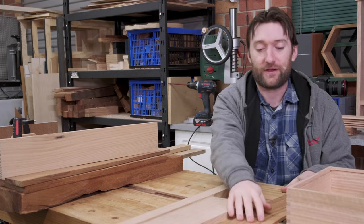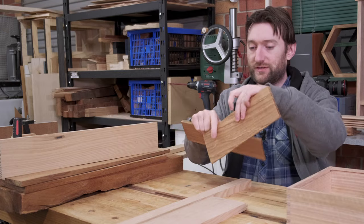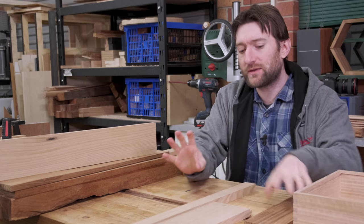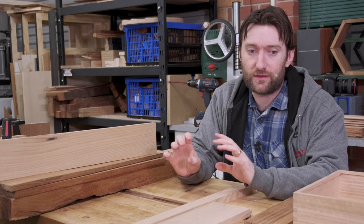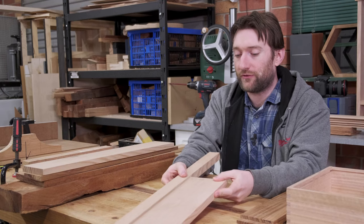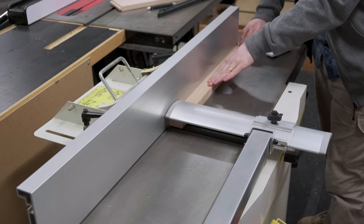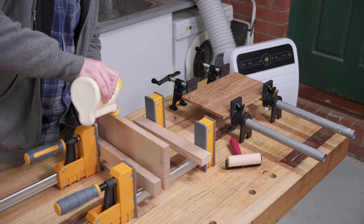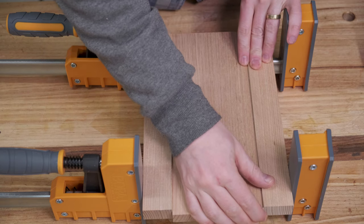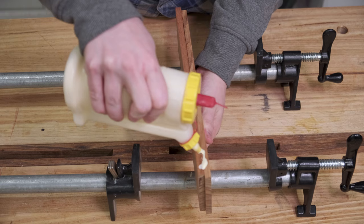For the bottom panel, I found this nice piece of blackwood which I've cut in two and jointed one edge — that'll make a nice panel. For the top, however, I actually want it a little bit thicker than the groove. I'll have a tongue going all the way around and I want to do some carving. I'm going with these two pieces here. This is a little bit too thick but that's fine — it's a very similar grain and I'll probably put a liming coat finish on top. So I need to cut this to a better length, joint it, and then everything can be glued up.